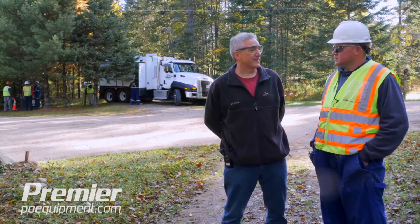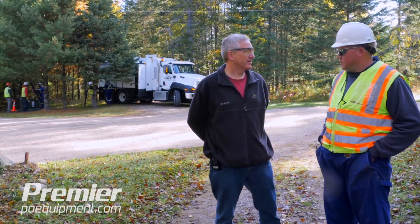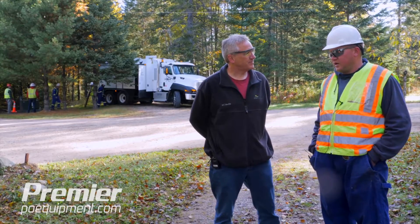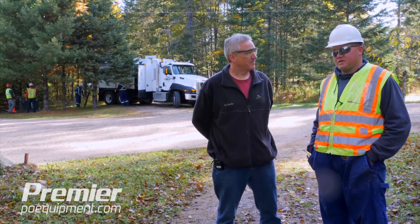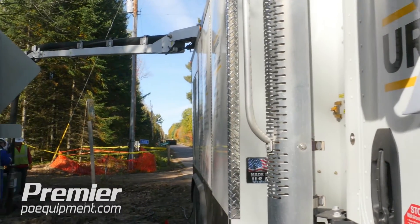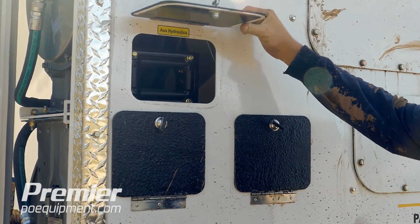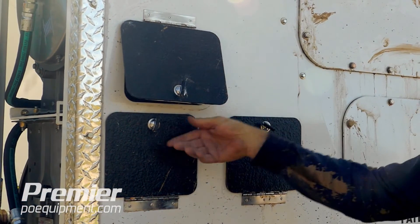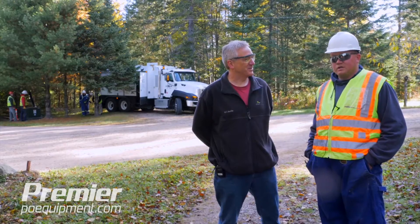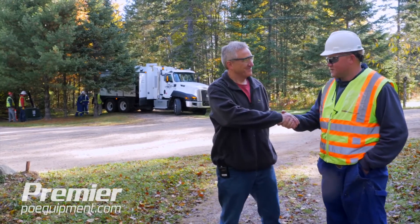Can you relate this to the gas, oil, and mining markets where this would be advantageous? The big one is for the pipeline company. They call it cathodic pipeline protection — they have to dig up the pipeline, sandblast off and redo the coating. With this machine they can hydro excavate or excavate with air, then use the air compressor to run the sandblaster to remove the coating, clean the pipe, check it, and put all the fill back — all with one machine, all in one package. Thank you very much. I appreciate it, Tim. Thanks for coming up and visiting.